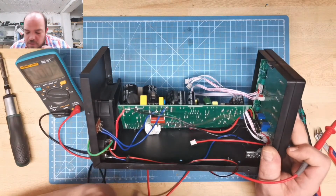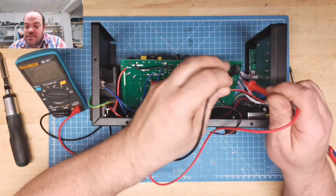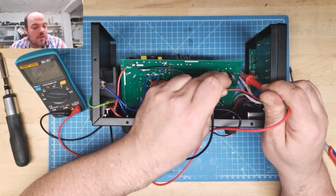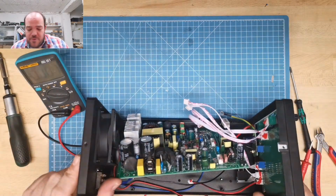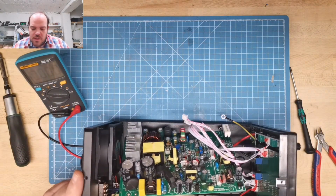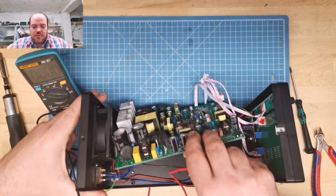Oh, maybe the little ones in the front from the secondary power supply. Yes, this is also a 400 volt cap. 1.3, that is okay. 1.3, okay. Survived. And these are also input caps or output caps. Oh, these two are also 400 volt.